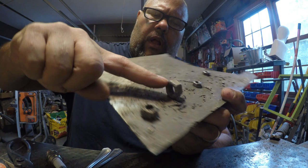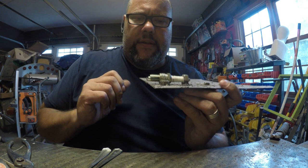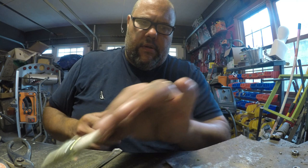Before we get to welding, I want to show you a jig I ground - just a plate with a nut welded onto it that holds the spark plug in position. I used to use this for height, but by marking the spark plug you don't really need that - you just hold it in place and weld it on. I did go back and grab a marker - I actually like the marker better than the soapstone because it's easier to see with the hood off.